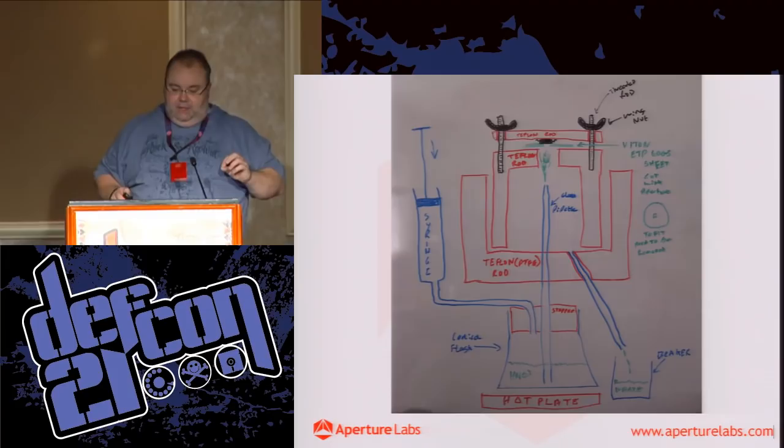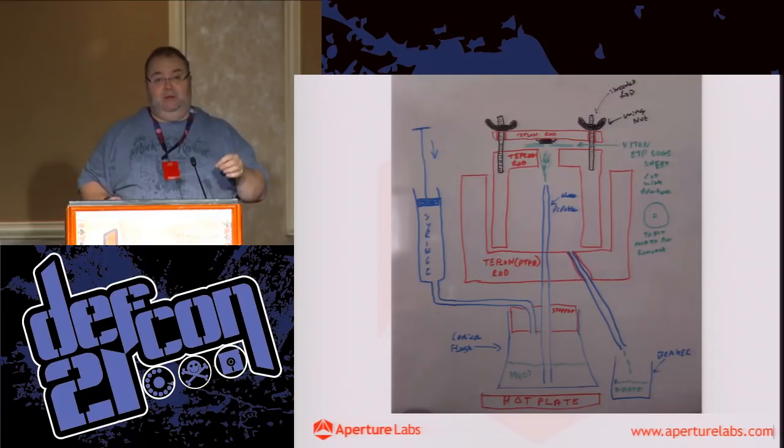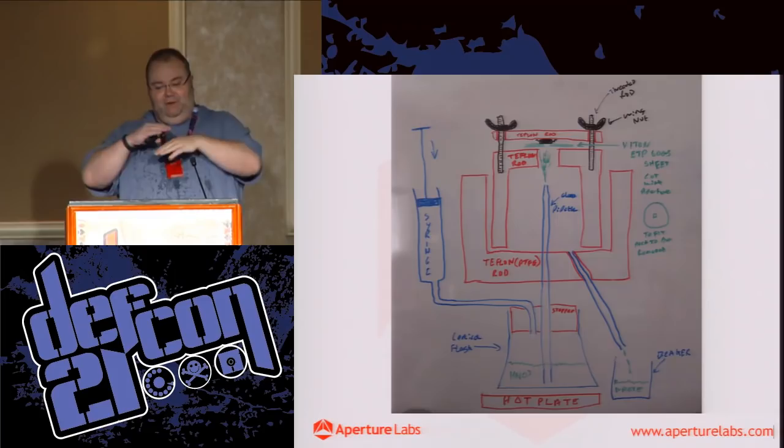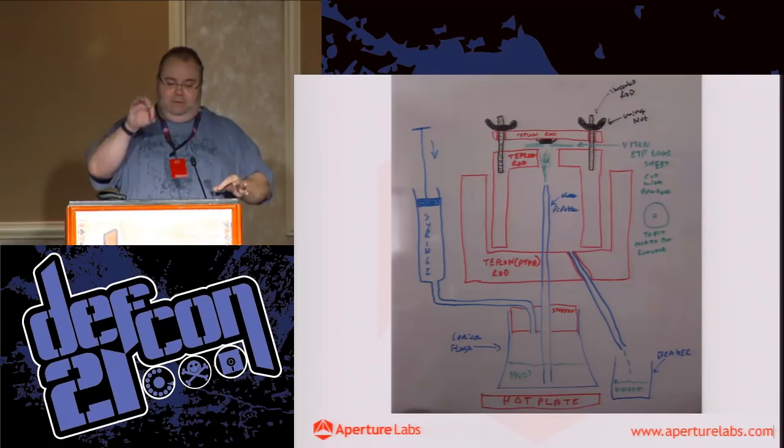And I also realized that once you cut the aperture in the Viton, a handy thing to do is to super glue it to the chip. So therefore it becomes a kind of monolithic thing, and the Viton isn't going to be slipping off the chip, etc. And I ended up using little strips of Viton with the hole cut in the end so you could put it in and line it up with the aperture that the acid is going to jet through.